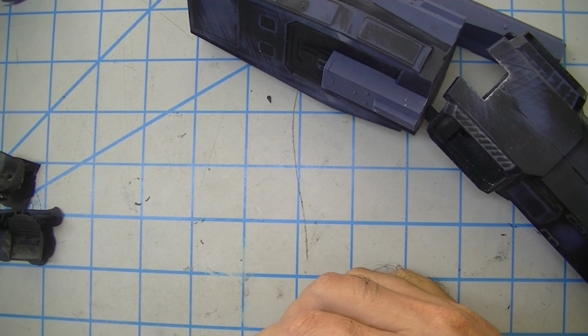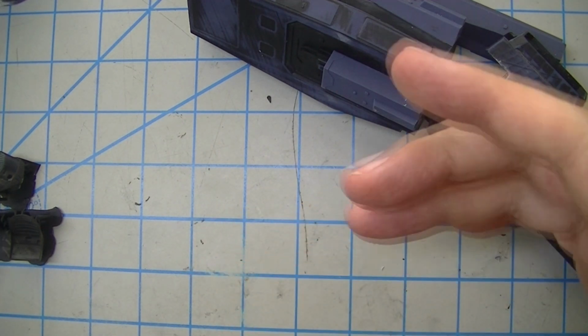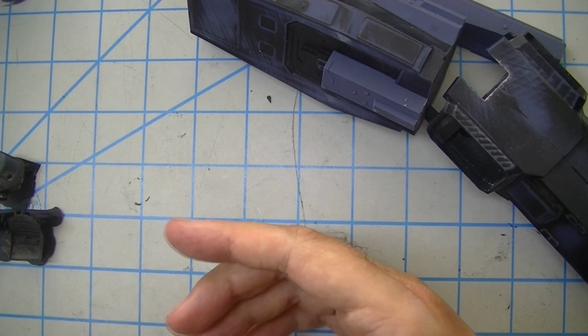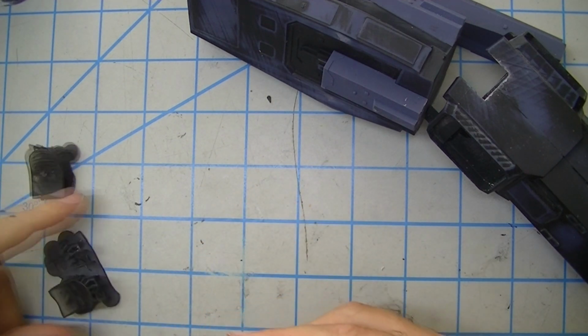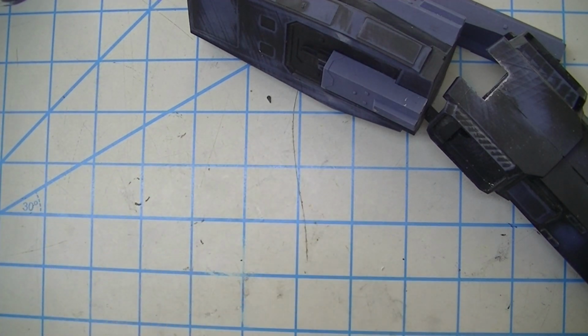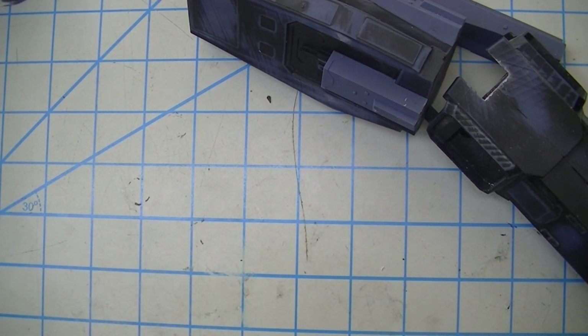And what's kind of ironic is that a lot of the people who will spew these rules about angles at you are people who print nothing but figures, Warhammer minis or busts or whatever. And truly, the specific angle on parts like that doesn't really matter, because the wrinkles in the soft surfaces pretty much hide most of the issues that the angles are supposed to help you with. Honestly, the main benefit that I feel like the angle gives you is it reduces your build time, because you have less vertical height. So anyway, that's kind of that on those parts.